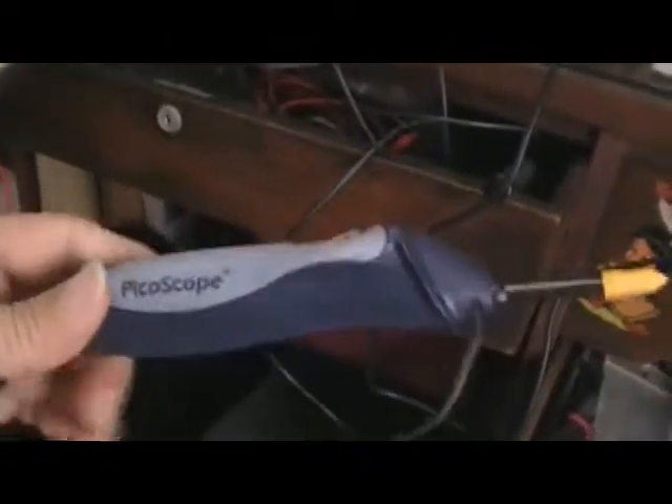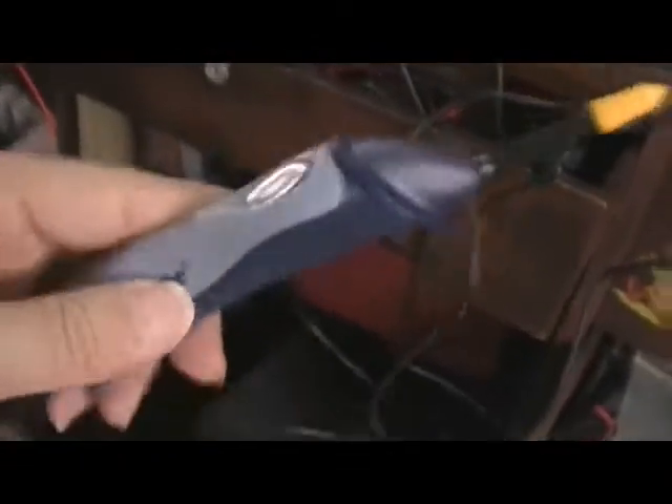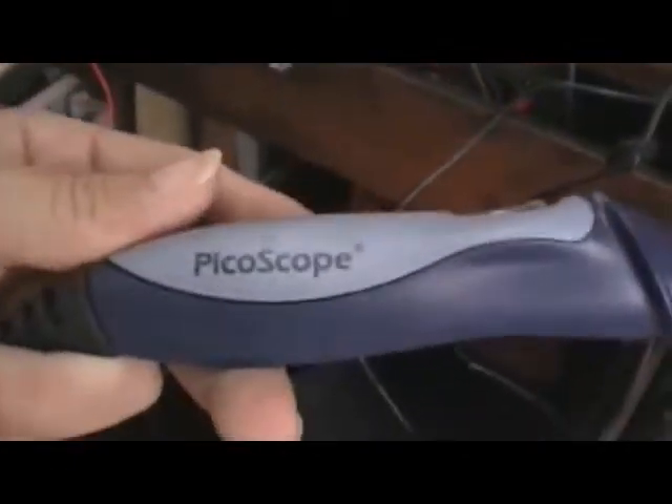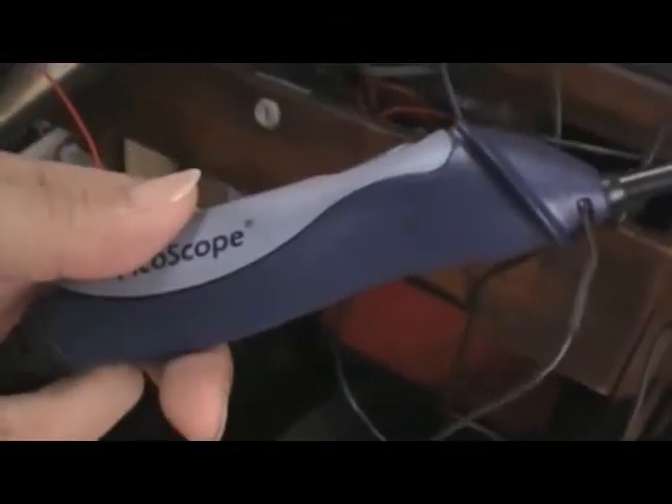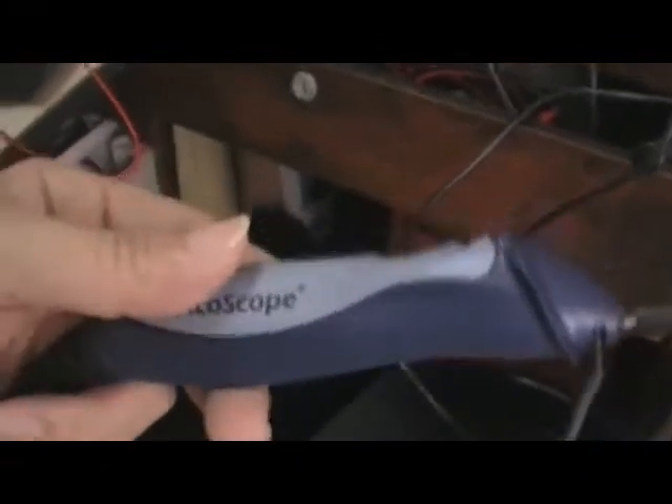The problem with this one is it has a very low input voltage — the maximum operating voltage is only 20 volts. Most digital circuits cannot work above 20 volts. I like that it's very small so with a small laptop computer you always have your oscilloscope with you.